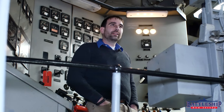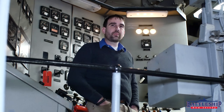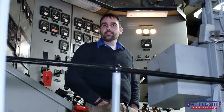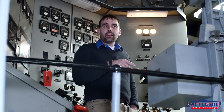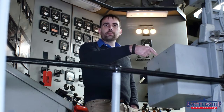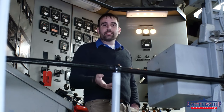440 power is three phase. There's three legs: A, B, and C. If there is a break in one of those lines or something else is going on, the power that's trying to get through that line is going to jump from the break to an unbroken line. Or, in a grounded system, to a ground.